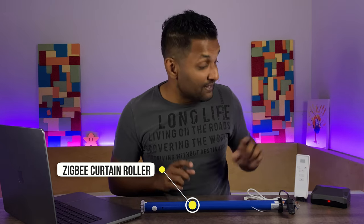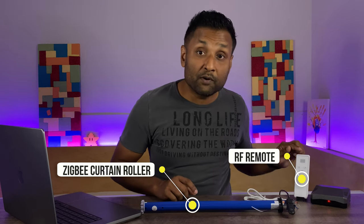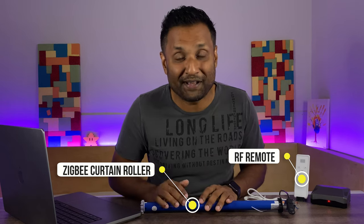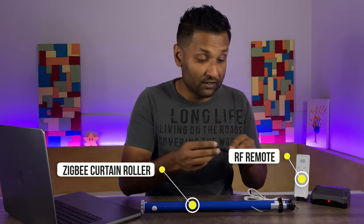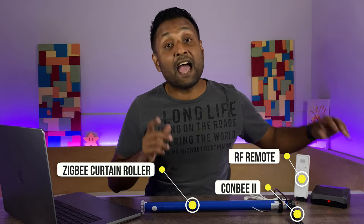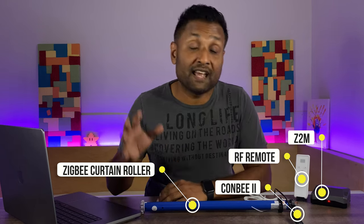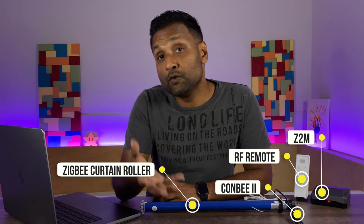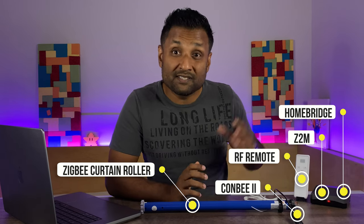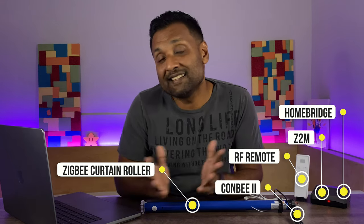For all of this to work with Apple HomeKit, you will need: one, a Zigbee curtain or roller blind motor — we will be using the Zemmysmart tubular motor. A caution: when you purchase these roller motors, please also purchase the RF remote that comes along with it. With the remote, you will be able to set the upper and lower limits and get bedside control. Two, you will need a Zigbee controller — we will be using a Conbee 2 stick connected to an Argon 1 that has a Raspberry Pi 4 installed, and you will also need the Zigbee2MQTT bridge installed. I've got guides in the description on how to install Zigbee2MQTT using a Raspberry Pi or a Synology NAS. And to enable HomeKit integration, we will be using Homebridge installed in the same Argon 1 — I've got guides in the description to install Homebridge too.